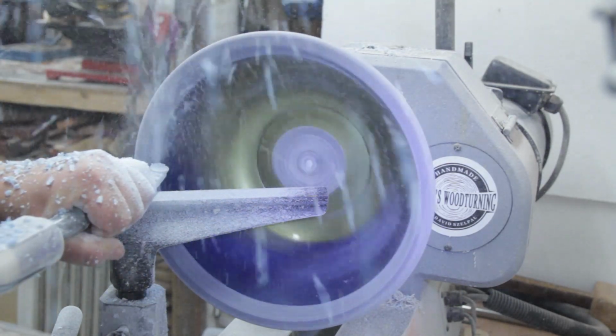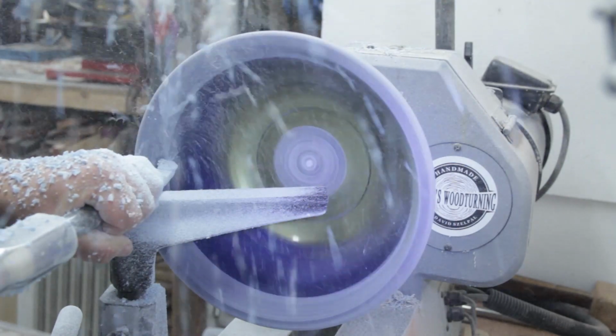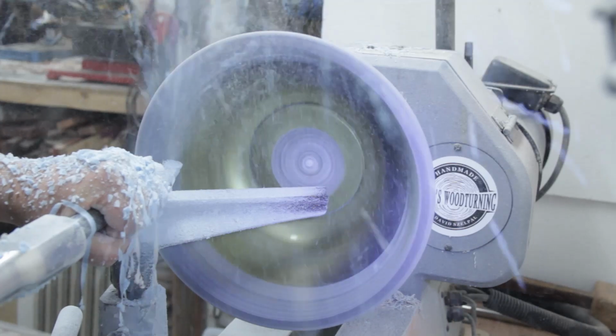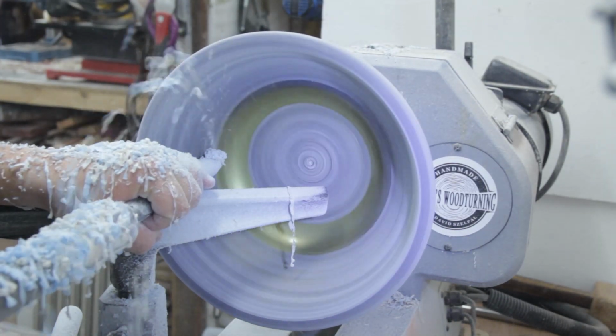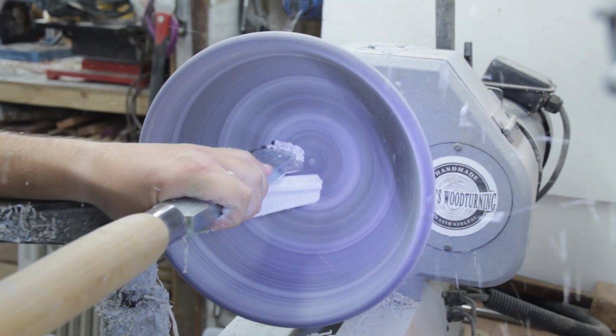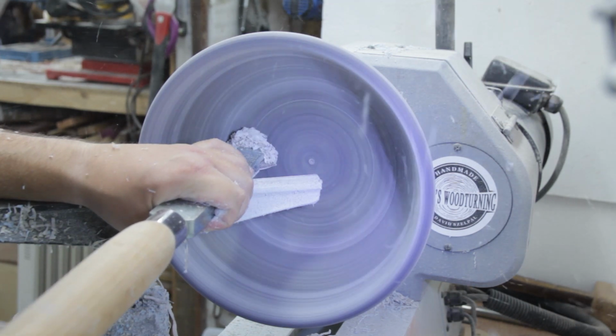Due to the size of the bore, I was getting a little bit of vibration when I was turning the inside of the bore. It would have been nice to use my steady rest with the free wheels to give some additional support to the bore, so you can reduce the vibration, which leads to nicer and cleaner cuts. But I guess this just means I should make a bigger steady rest.